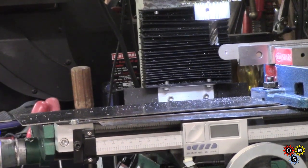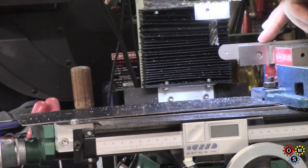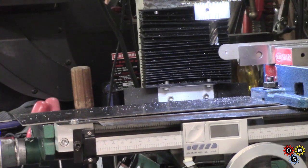I'm not going to take half a mil off each side — half spot on that end. The cut was very light all the way; I got this dialled in to within about a thou. So we've now got a nice smooth edge. I'm using a 7/16th carbide 5-flute, which I happen to have. I had some smaller carbides but they're 2-flute, and I thought a multi-flute was going to be better on here because it's such gnarly stuff. I'm going to flip this over, probably use some more parallels to get packing so I can flip it and probably not have to indicate.